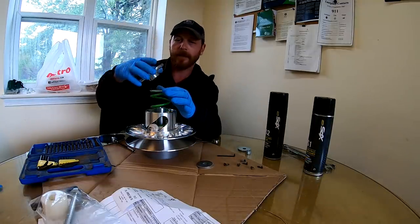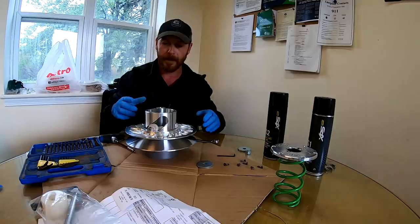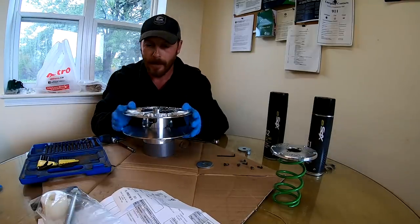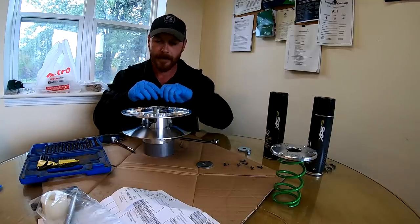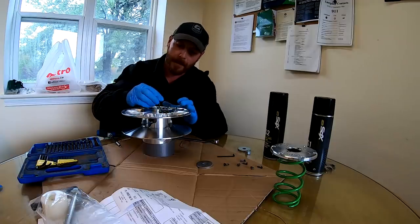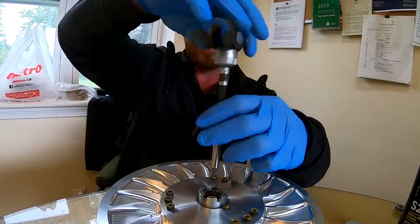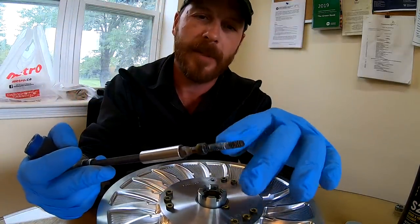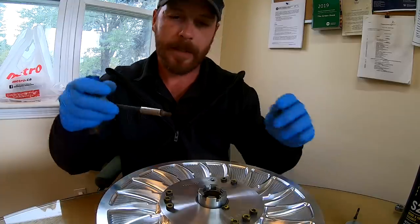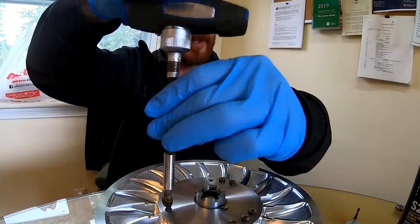You got yourself a little plastic spacer there — you want to make sure that's staying on top. At this point we can pull our spring out and set that aside. Then we can flip this bad boy over and utilize our tape roller; it's nice to have something soft. Now these ones here are torqued in there pretty good. From what I gather they're not the same size, and we can find a metric that fits those nice and tight — the 4mm. That is a nice tight fit. That actually wasn't torqued all that much, came out of there nice and easy.